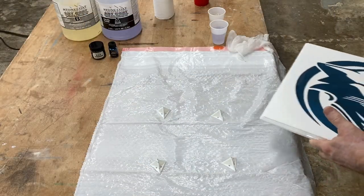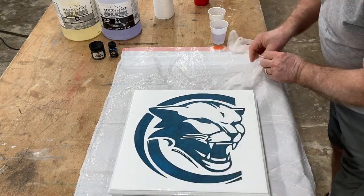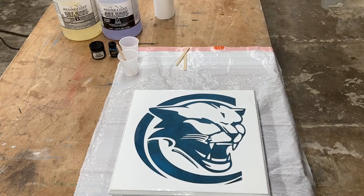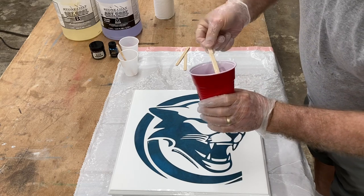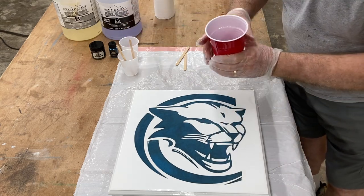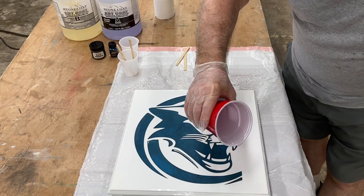It's the next morning. I went through and sanded this starting at 120 grit and went all the way up to 320 grit, and it looks just beautiful right now. But it's time to put that top coat on, and after mixing it for at least two minutes, it's time to pour it on and make this sign go from fantastic to absolutely gorgeous.